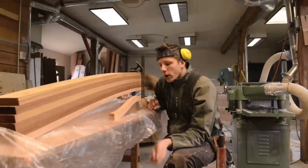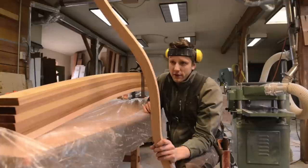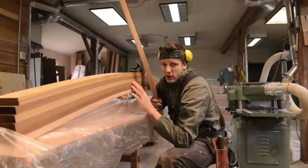So that little theory I had came from, well, probably something I read, but I tried it out with this piece of Doug fir, and you can see this is all laminated strips, and it actually looks like one piece of wood at first glance, because Douglas fir is a lot more uniform in color than red cedar. So if you're gluing up beams out of Douglas fir, this theory will work great. If you're using red cedar, don't bother. Just use whatever wood you got.